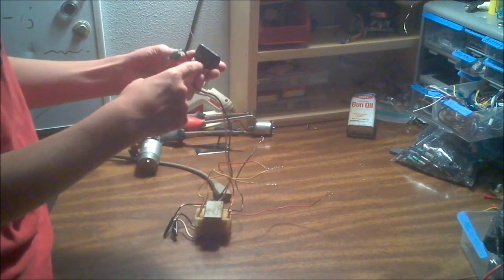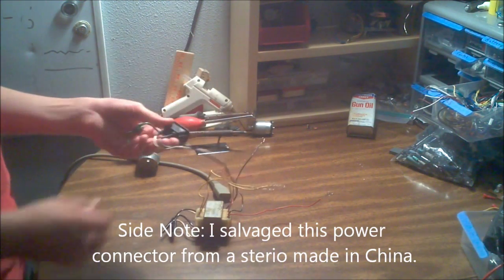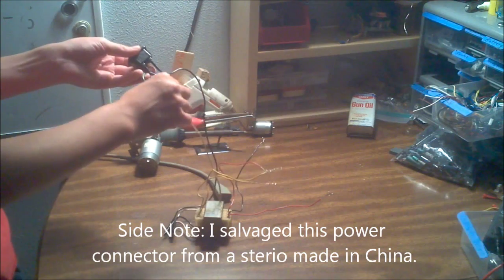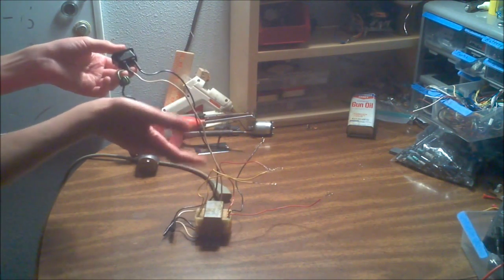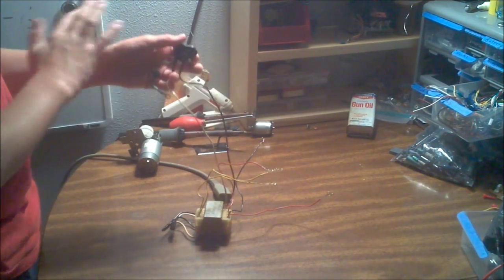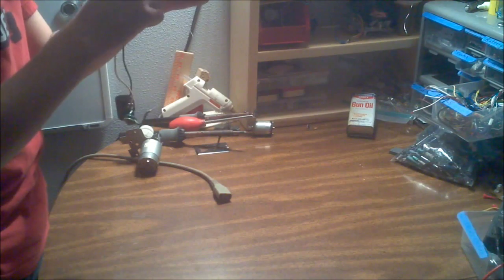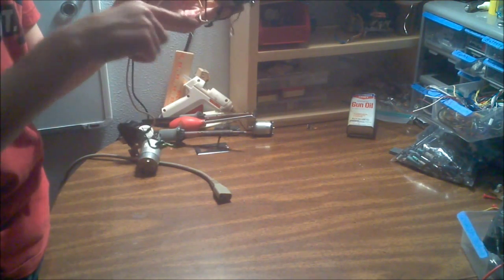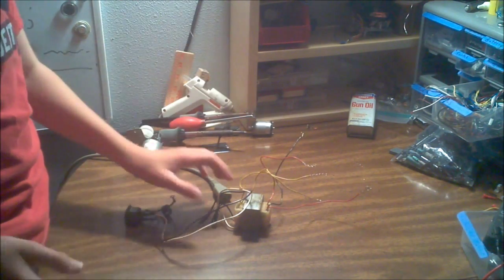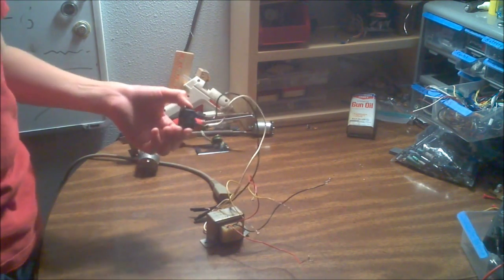This power connector was incorrectly wired. When I tested it, the wire that is actually hot is the one that's usually white, and the neutral is actually black — very confusing. So on my transformer, which had correctly labeled hot and neutral wires, I had to hook them up backwards: black to white, white to black. Make sure your wiring is correct before you attempt this project.